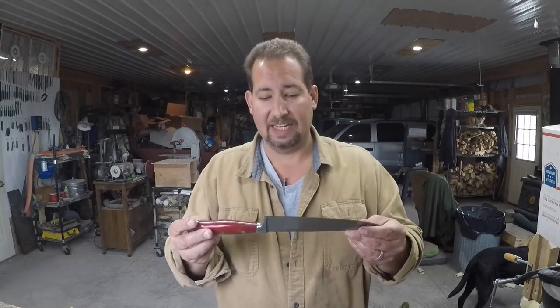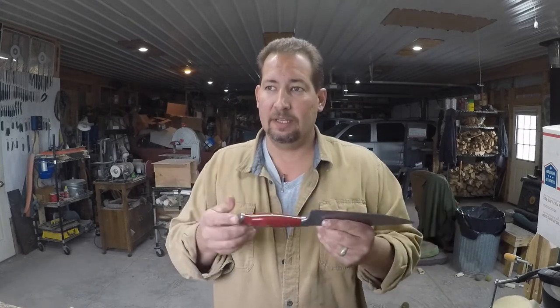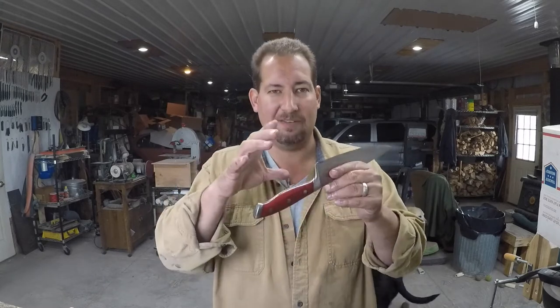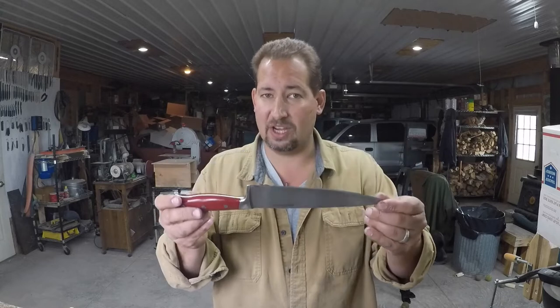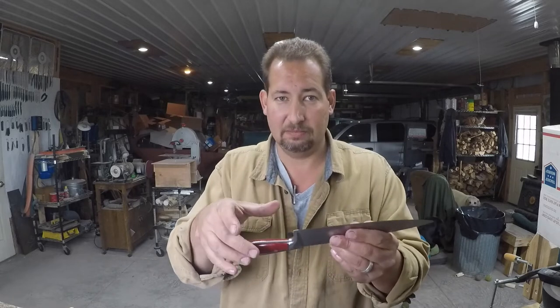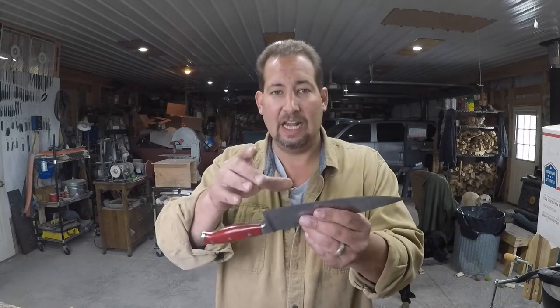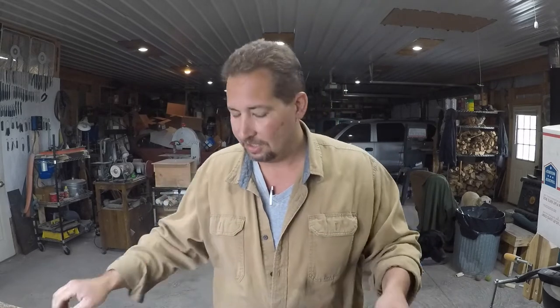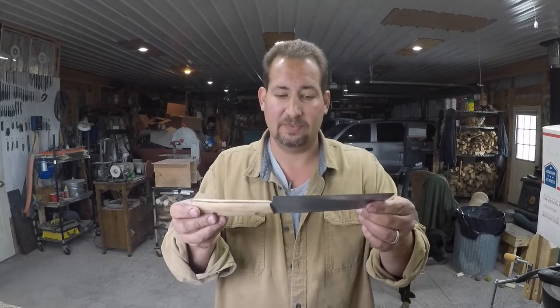That's about all I'd suggest you do on a typical knife that's kind of balanced. Where you have a knife like this Faberware - it's inexpensive, it's soft stainless steel, but it's balanced. The steel is soft, but the geometry is thick to make up for the soft steel. If the steel was harder and fine grain, then you could thin the blade out considerably and it would be a balanced knife again. Something like one of my very early kitchen knives is an extremely unbalanced knife for anything but a meat cleaver.